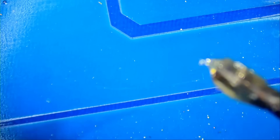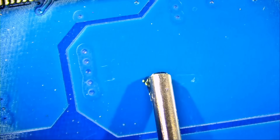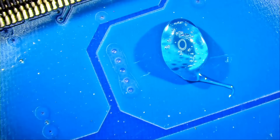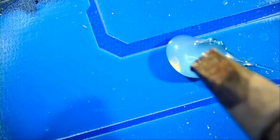I have a blue board here. I'm going to apply a blob of flux — you've seen a lot of my videos. This is the Amptech flux and ours is the clear flux. It's formulated in the lab. It's more stable, more durable, longer shelf life, no odor. It works a lot better under heat than Rosin, than Amptech. It lasts longer under heat, it doesn't evaporate as quick. So you use less flux to do the job. I'm going to apply my soldering iron over the flux at 480 degrees Celsius.